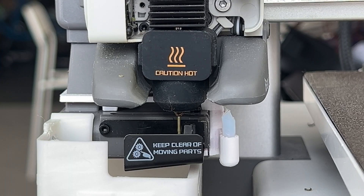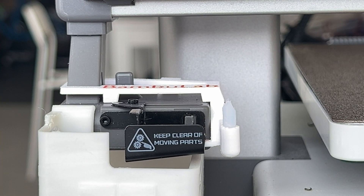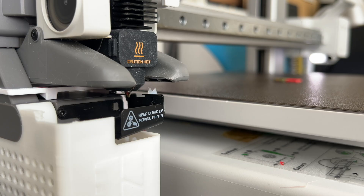My solution is keeping the purging blade in its original shape — the 2mm notch and 90-degree left curved top — and adding a snap-on wiper module that holds a specially cut V-shaped PTFE Teflon wiper. You may ask: it's basically the same design as the others and will also capture ooze on the right side of the PTFE wiper.